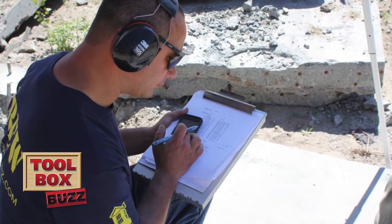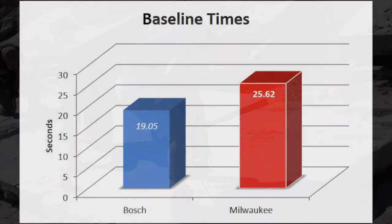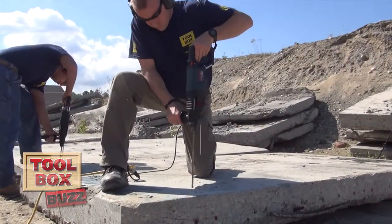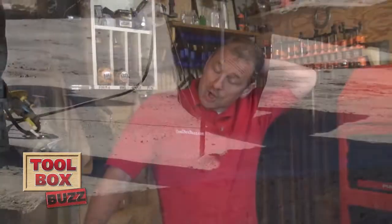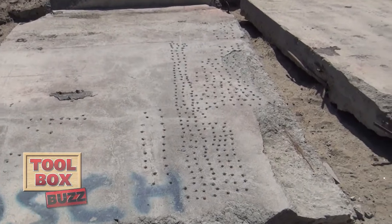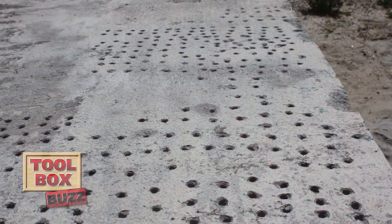To test the performance of these bits, we timed a sample of 26 six-inch deep holes, removed the outliers, and determined a baseline speed from 20 holes. To control for variables in operator use, we maintained the same operator for each sample for each bit. We then proceeded to drill six-inch holes repeatedly to simulate heavy-duty regular use, drilling 315 holes for each of the bits tested — that's the equivalent of 630 three-inch deep wedge anchors. Once we were done, we repeated the same 20-hole baseline time test, throwing out the outliers, and compared end-of-life speed to determine performance degradation. When all was said and done, we drilled over a thousand six-inch holes in one day.